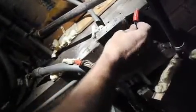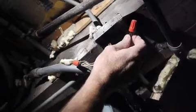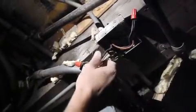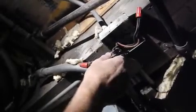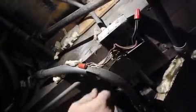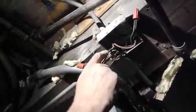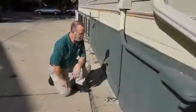Now you can't tell this, but this space is only about 6 foot tall. If we had a tall electrical contractor down here who was bald-headed and hit some of these wires without nuts on them, he could be electrocuted. This is problematic. Also, these are commonly chewed by rats and mice, who can actually live off of the insulation that's on the cover of the wires.